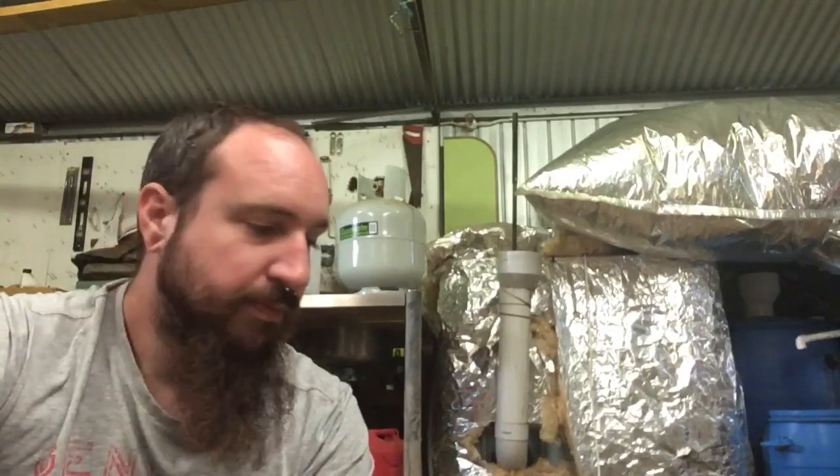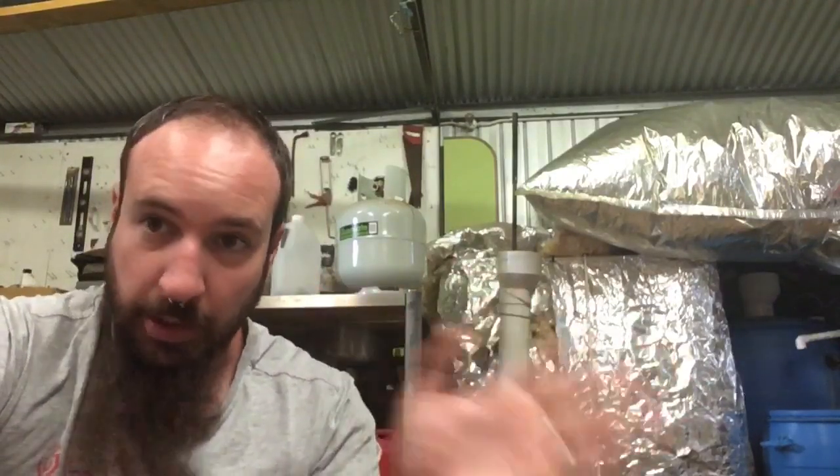As I was saying before — the phone rang. So next time I'll have a proper setup, not just bricks on the floor. I know I could probably cop a bit of flack for that, as bricks are not refractory — they absorb heat. The crucible I'm using is cast iron, which also absorbs heat. I know, I know.